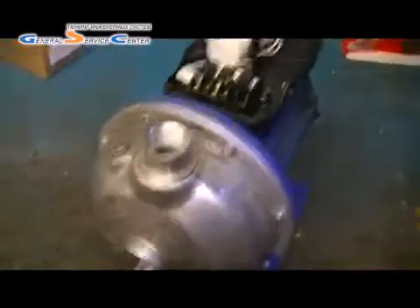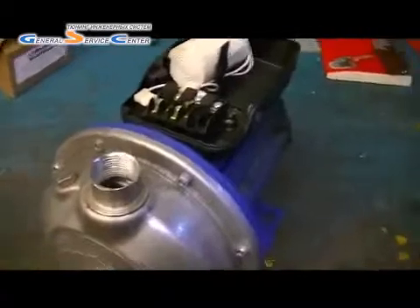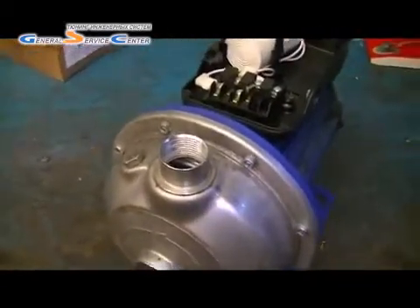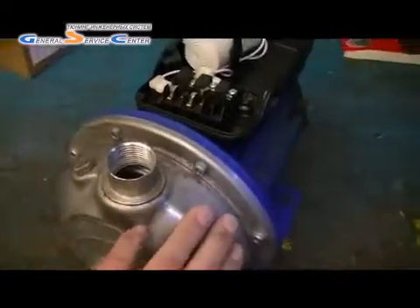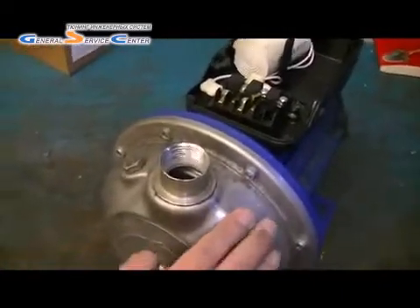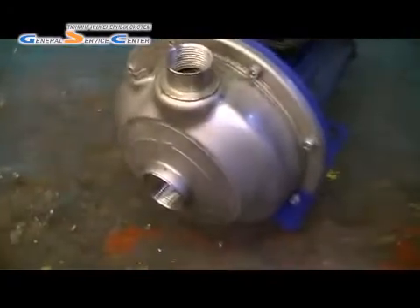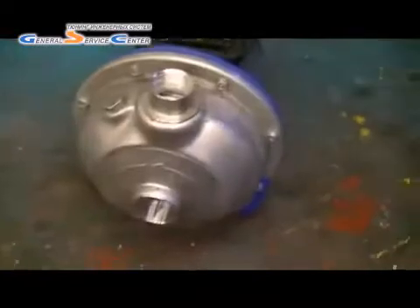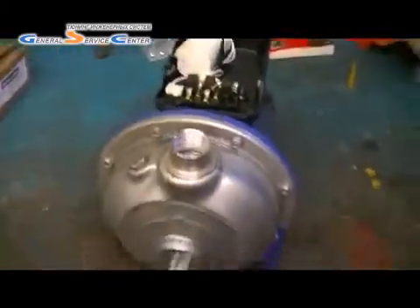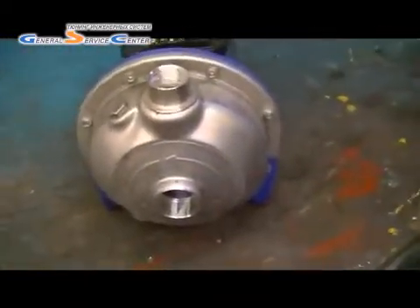This is the bottom part, and the condenser pump is feeding... this goes to the condenser. Basically the condenser pump feeds the water system to cool the ammonia down — the vapour — and send it into a liquid under pressure. So this is the feed to the condenser to put that water into the pump sump.